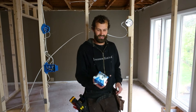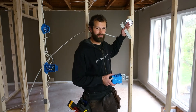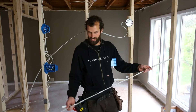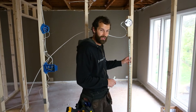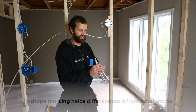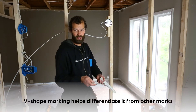One of those is this adjustable box. In the context of this bathroom, we have a bathroom vanity light and an outlet-switch combination that's going to be located at 44 inches above finished floor. I'm using my fiberglass folding ruler, which provides insulation from the risk of electric shock. I'm marking my 44 inches with a V on the face of the stud — that V shape helps differentiate my subtle pencil markings from other markings that might remain.